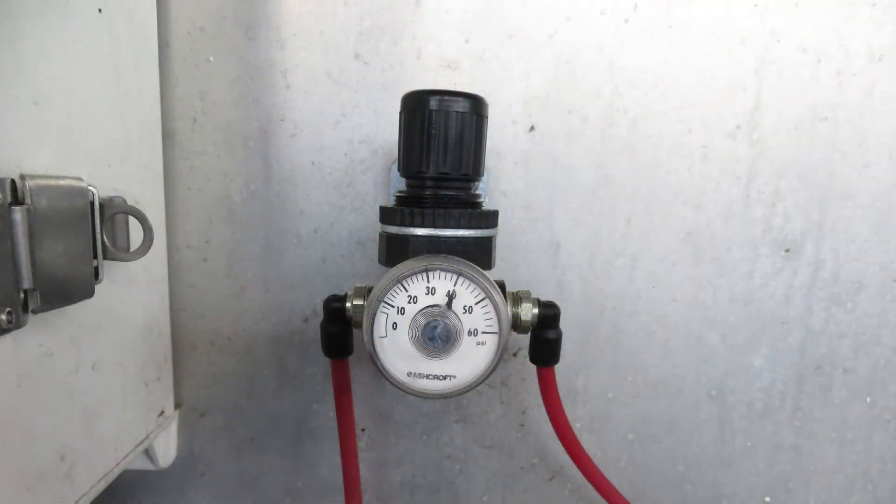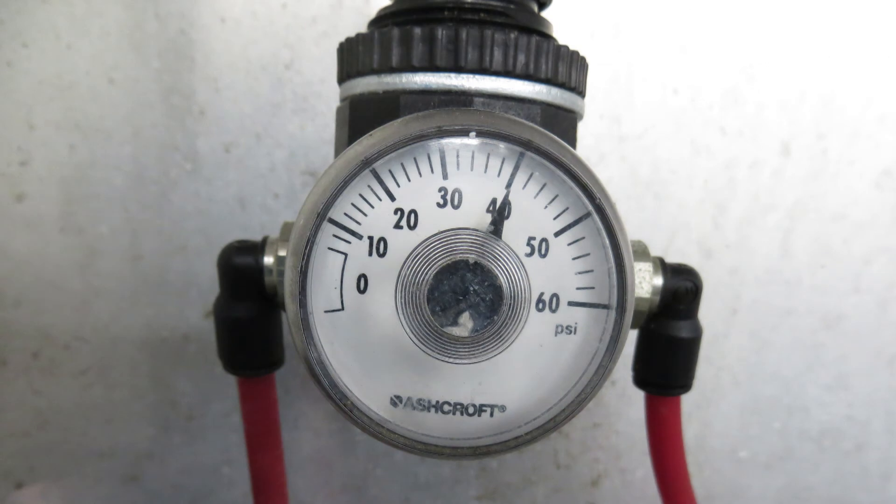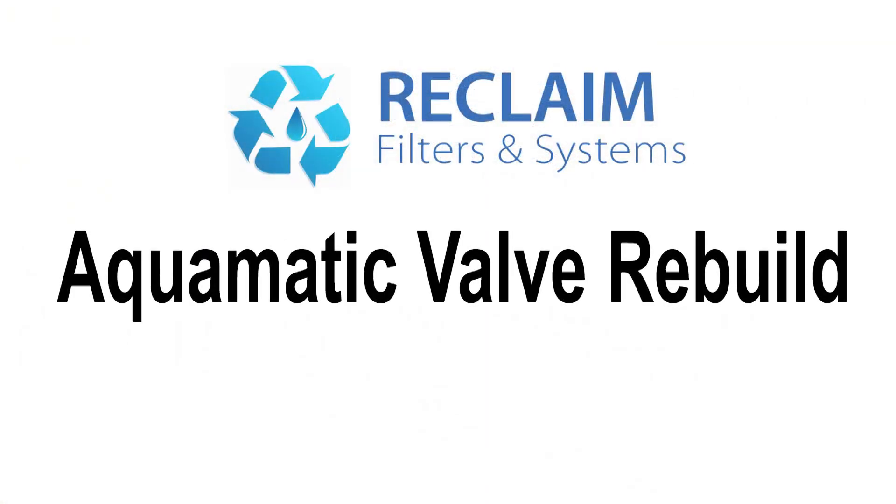Reconnect the airline. As a recommendation to increase the life of the valves, it's a great idea not to slam them with full air tank pressure which is usually 90 to 120 psi or more. I like to use a small air pressure regulator and crank down the pressure to about 40 psi. That seems to operate the valves very smoothly without slamming, and it also puts less stress on the gasket we just replaced. Now restart the system and check for leaks. And that's it — thank you very much for watching. Good luck, and if you need seal kits check the link below.